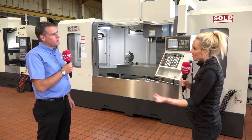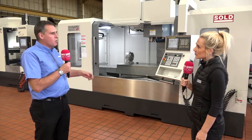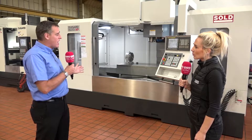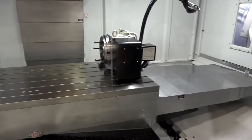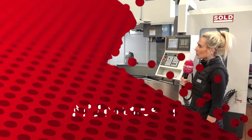That's a pretty heavy machine, but what's that going to do for the engineer? I think it gives two opportunities really. People machining heavier type materials — it gives them the strength and the rigidity. With the counterbalanced head on there, you can do decent cuts on heavier materials. But of course, with the capacity this machine has, if you've got larger fabrications, it gives you the opportunity to machine those with confidence that the machine's rigid enough that it probably won't vibrate when you're doing your cutting.